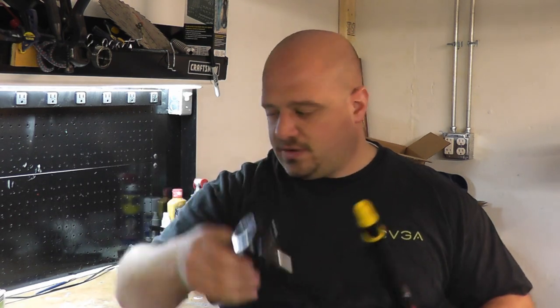And this is from a cheap $15 Targus tripod that I had bought at Target, I believe it was. And this is the same thing I've been using on that swing arm that I have mounted to the wall. Now this already has an adapter stud to adapt from the end of this to the hole in that little swing arm, and is just shy of 5/16. So what I can do is turn this down to 5/16, drill a 5/16 thread in there, and screw this sucker right in there. Now obviously it's going to be hanging upside down like this,